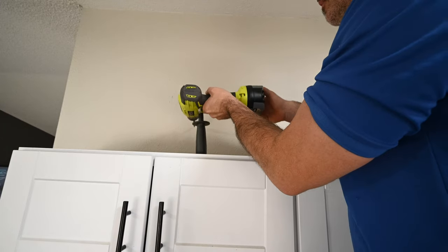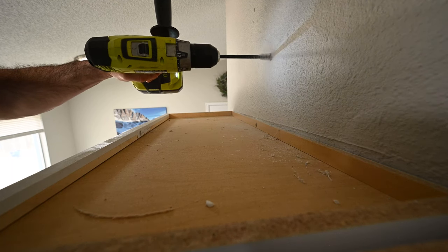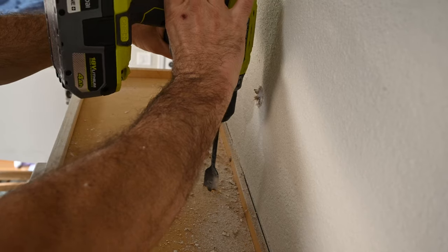You also want to make sure it's in a spot that can be heard everywhere inside the home. I've got a 1,400 square foot home so it can pretty much go anywhere. I'm choosing to put mine in the living room up high. The easiest option is going to be borrowing the power from the microwave receptacle. To do that I'm going to have to drill a couple of holes — one through the wall that goes into the pantry, then through the top of the pantry wall out into the living room.